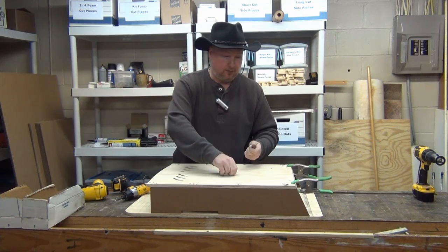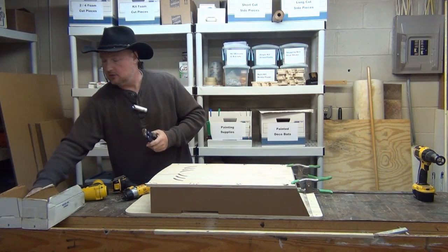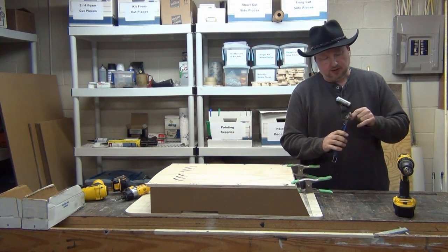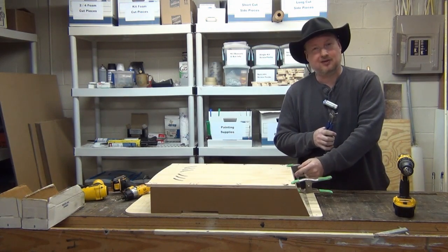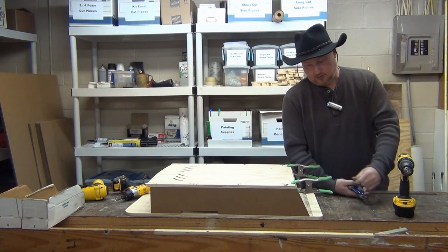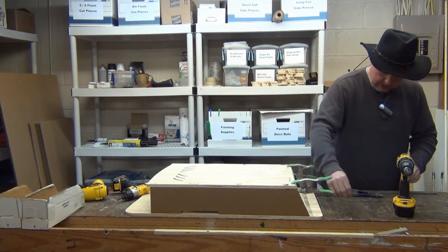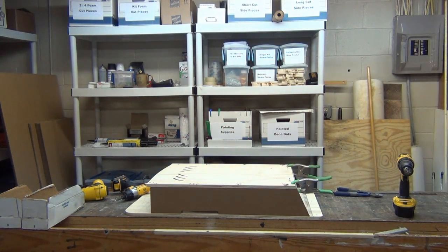For the front roof brace I use one-inch exterior screws and cut just the tip off. I can't find any seven-eighths inch; I found some three-quarters but they're not long enough. Because half-inch material is not quite half-inch, the tip just barely pokes through, and we wouldn't want the bats to get injured on that. So I snip that sharp point right off, and without the point we don't have a problem. I need to throw those snipped points in the trash so we don't pick them up again later.